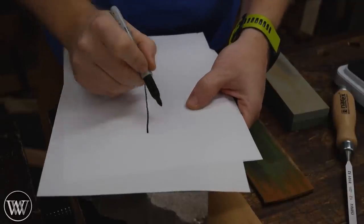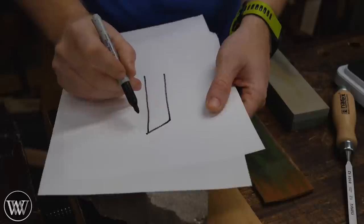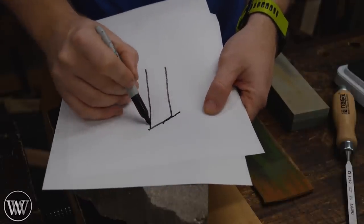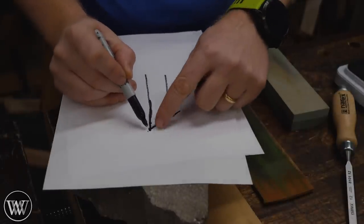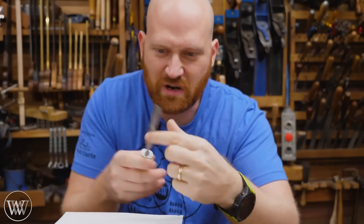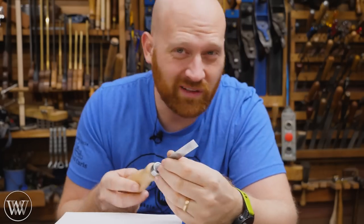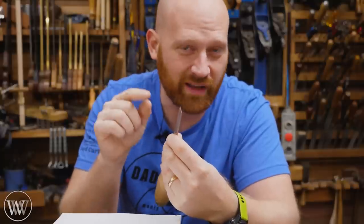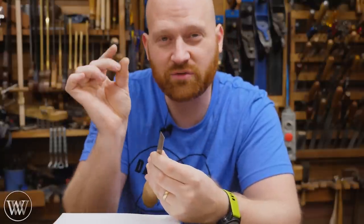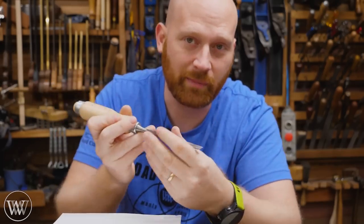A sharp edge occurs when two planes meet — we're going to put a bevel on the end of this, so we want to create a sharp edge right here where these two planes come together. If I grind off material here and here, this should come to an infinitely small point. The problem is steel is not the incredibly solid thing we think it is. When you get down to the molecular level, it acts a little bit more like a fluid — it likes to move around a bit, and warp, and bonds move back and forth. So you'll never get an infinitely small edge, and that edge may break off, fracture, or bend.